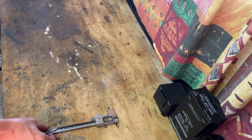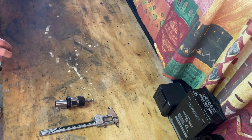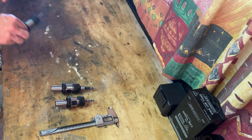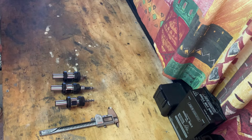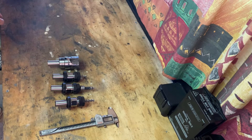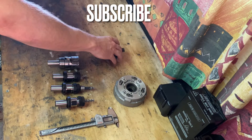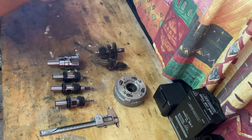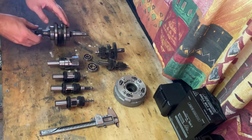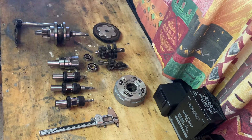In today's video I will take you through the process of turning the rough casting into a functional crankcase. All of the machining was carried out using these three cutters. I also used a dial indicator and edge finder for setting up the work on the machine. I also had a whole bunch of engine parts from a Lifan engine lying around, which was quite handy as I needed to use these to test fit to the crankcase to ensure everything was where it should be. All of the dimensions for this project were taken from a pre-existing Lifan engine.